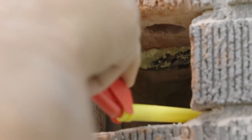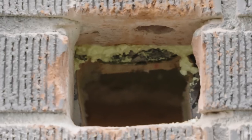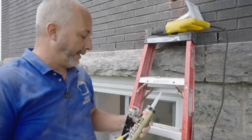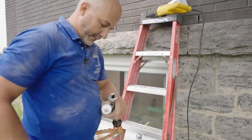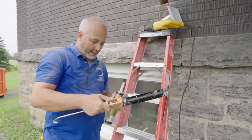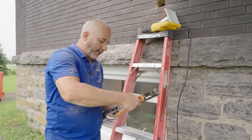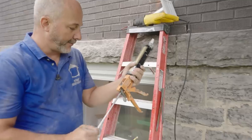I'm not trying to insulate this hole — I'm trying to divert water trapped behind the brick away from my wood. Now I'm comfortable putting this in. I'm going to take my exterior sealant — white polyurethane exterior caulking. There are lots of companies that make these products. I do like this Mulco though — it's a good product to work with, and it's for exterior only.